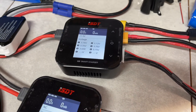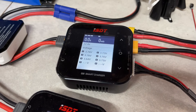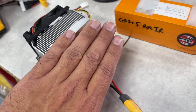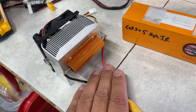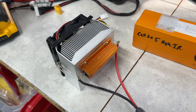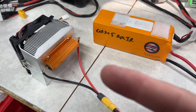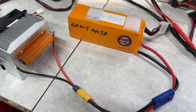These will kill a battery but it's really slow — maybe 0.3 milliwatt hours per hour. After an hour each cell dropped by about 0.02 volts. So I'm hoping this setup is going to speed things up. The aluminum housing is getting warm — you don't want to be touching that for very long. I'm going to let this percolate for a while. The wires are nice and cool so we're not drawing a ton of amps — we're just getting a lot of heat out of this. It's certainly making a lot more progress, and once we get past a certain voltage the wattage comes down and it'll get a lot cooler. I may just take this down little by little over time. This is my idea of a lipo killer.